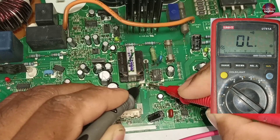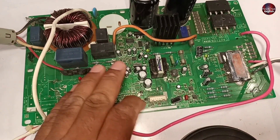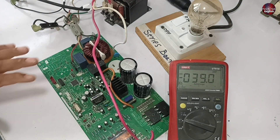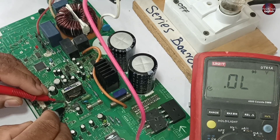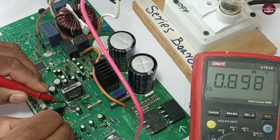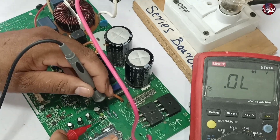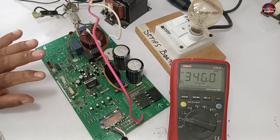The multimeter is not making the beep sound now. If we get such a problem, we check the motherboard randomly. I will install all the parts back in this control board. Let's check now whether the motherboard shows a short circuit or not. In reverse bias, this diode is showing 0.888 volts — it can show a voltage drop in reverse bias when installed in the circuit. In forward bias, it is showing a 0.446 voltage drop.